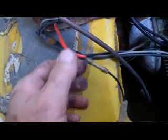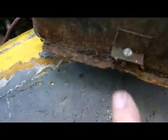Here's the fuse, the positive wire with a butt connector going to another butt connector — and that's an exposed live wire when the battery is connected, so I need to fix that. I'm going to take the cover off. There's a little bit of rust and someone put in a wrong screw — not the right thread, just wound in and corroded. The screwdriver was slipping so I had to cut the head off.